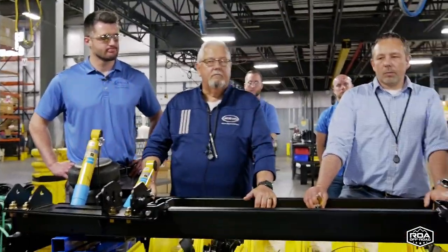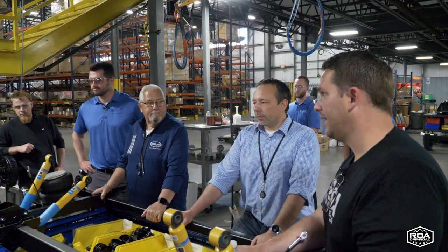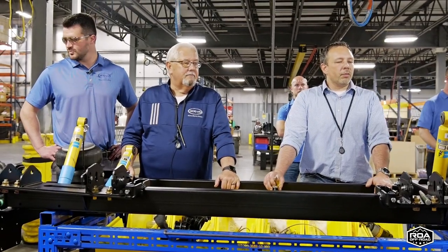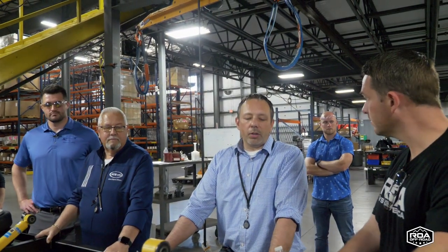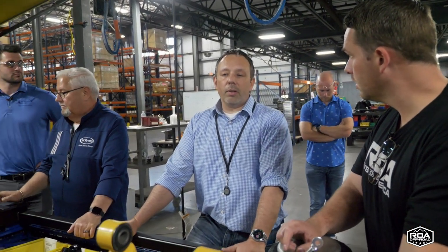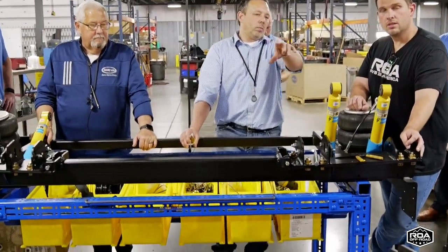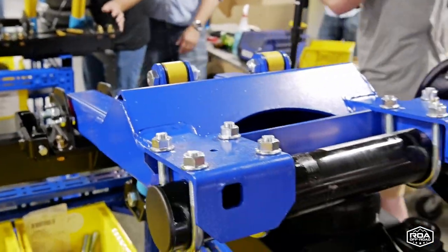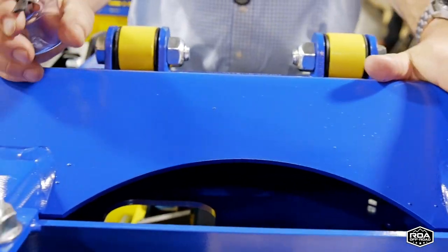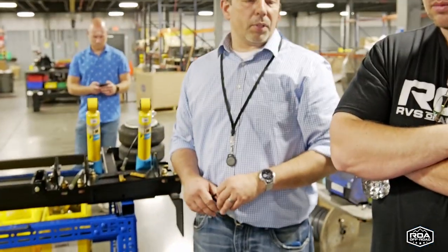Do we know the load test rating, or has that been put under a machine? We did some early cycling, but as far as testing the suspension, we did that in durability. We identified some changes we made after durability. We saw a little bit of loss of camber, which resulted in a whole restructuring of this section right here, where we saw a little bit of movement. So we pulled all this together, and that was helpful for us.